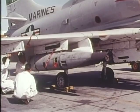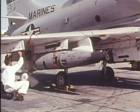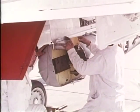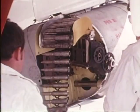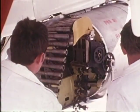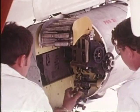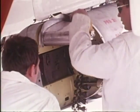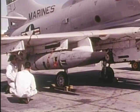The GPU-2A can be easily loaded and downloaded on or off its carrying aircraft. For loading, the aft fairing is rotated out of the way. A separate ground support loader mechanism is attached to the aft cover lugs with quick release pins. Linked 20mm ammunition is then inserted into the loader. By using a ratchet drive wrench, ammunition is drawn into the loading mechanism, delinked, and inserted into the storage drum. The loader is also capable of unloading the drum and relinking the ammunition by reversing this operation. Complete loading of an empty drum takes less than ten minutes.